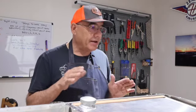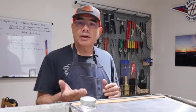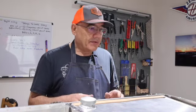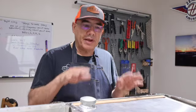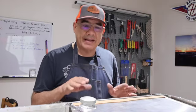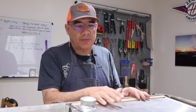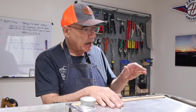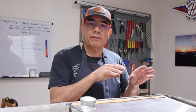So where we're at is the bottom skin, we finally got it riveted to the bottom. Now we came to the top of the skin, and there were a couple of things to get done before we could get the skin on. What we had to do first was take the fuel tank, open a hole in the side of the fuel tank, and mount the fuel float.